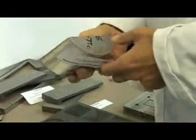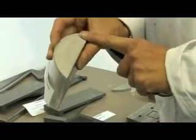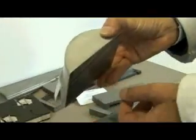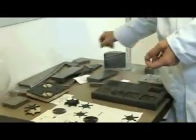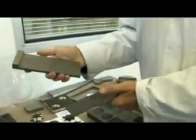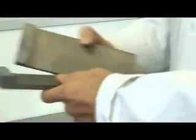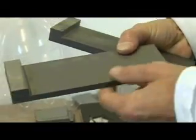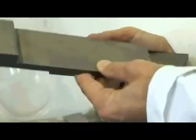This was cut with the water jet with abrasive — we put abrasive in there, not pure water. Quite often this is a titanium sample and that's the surface finish — it's a very flat surface finish. Whereas if you go faster it will cut quicker but you get what they call striations. That's still pretty good — it took less than 15 minutes to cut that.